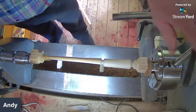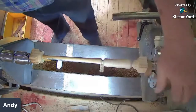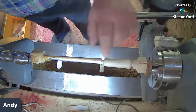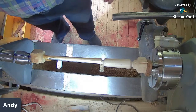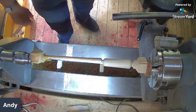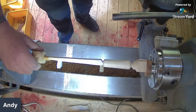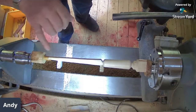When you're going to fire the lathe up now, you really want to be on the lower speed and then ramp it up to the running speed. Otherwise, if you start it, you can end up tearing the whole thing out. It's not too bad in that there's still a reasonable thickness there. The live centre is part of an Axminster multi-live centre — it's about £83 for the multi-head live revolving centre and additional tips, and they do it in one or two Morse taper.